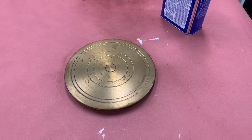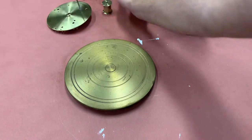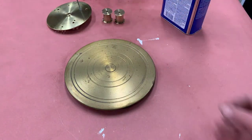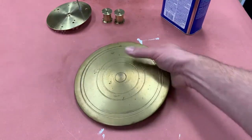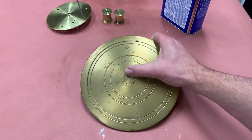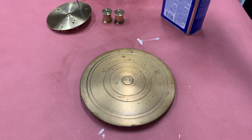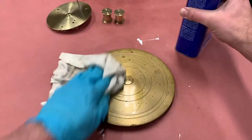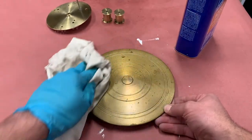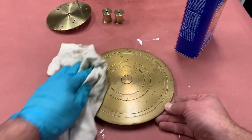Those of you that have followed my channel know that I always agonize over how much polishing to do. I've got the main plate looking pretty good — I've got a coat of lacquer on that, and I lacquered up the spindles. Those look pretty good too. I got looking at the pendulum and thought I should probably do something there. This pendulum — these grooves had black engraver's wax in them, and the whole thing was lacquered and spotted and in need of work. So I've been taking some lacquer thinner to get rid of the old lacquer, which does also remove the black detail in the lines. I'm not worried about that because I have done some dial silvering work, and re-waxing is a step in that process.